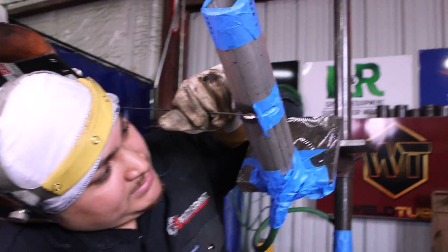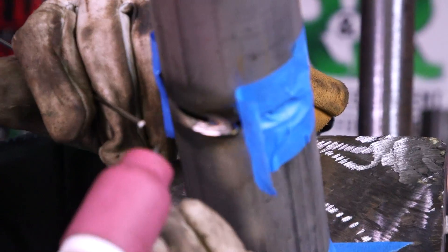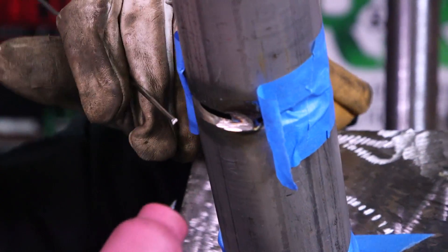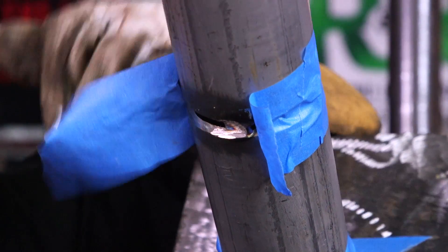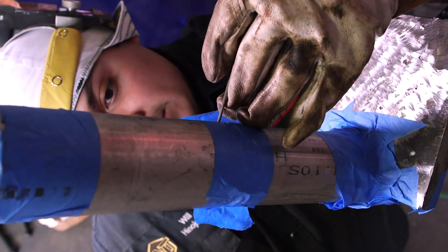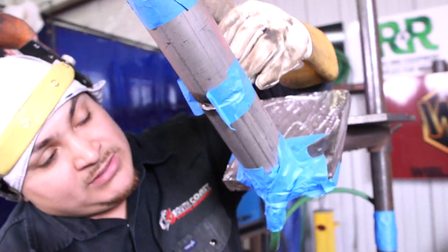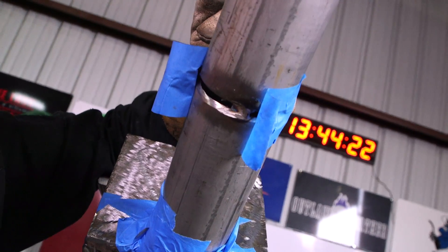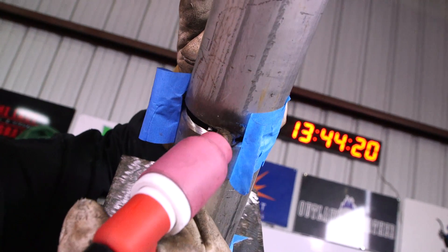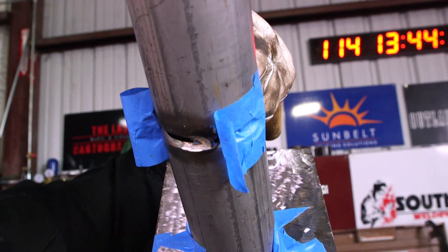So I feathered my tack. Whenever I'm welding alloys, what I do is I light up on the tack first, watch it burn out, watch it make a keyhole, and then I dip — keyhole dip. If you look, I'm going to backfeed it from the top, just like this. I'm sticking it in through the wire, through the tape. You can see that the wire is going to come out on this side. Then it's just dip, keyhole dip, keyhole dip — just up and down dip. That's how I'm going to do it.